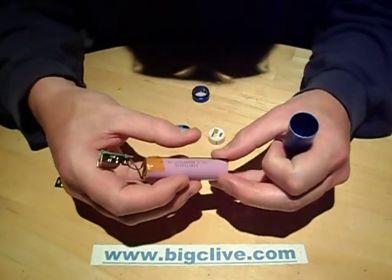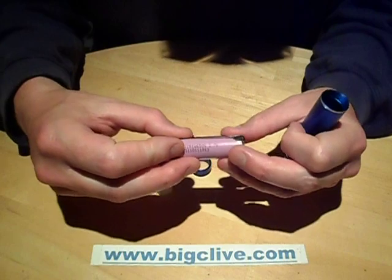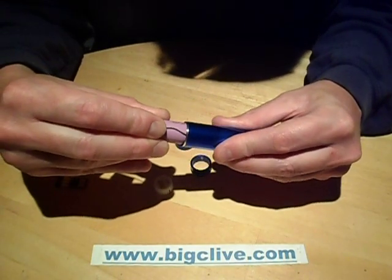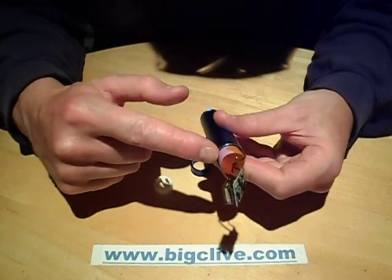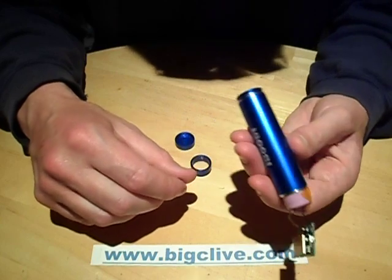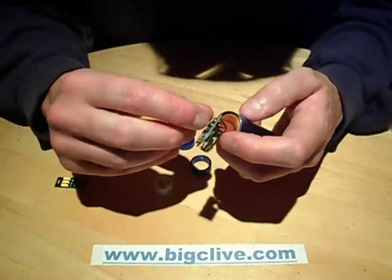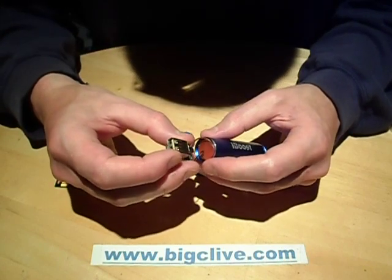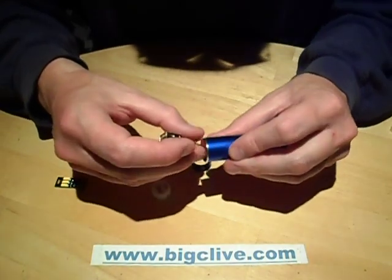I'll show you how this goes together because it's just a little bit squirmy. It's got a bezel, an insert, and an end cap. The reason the wire came off and the reason all the heat shrink is a bit torn is because this is just an excruciating fit — squeaky tight. I'm glad that the negative is the outer shell of the lithium battery, because the chance of the heat shrink sleeve or the wire being damaged on the outside is quite high, as it has already been damaged during manufacture. The positive is protected by that little cardboard disc. Because the insulation is being compromised, you have to regard the outer shell as being at the negative, so you don't want the circuit board to touch it.